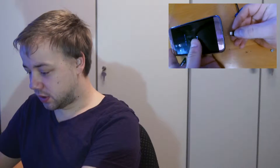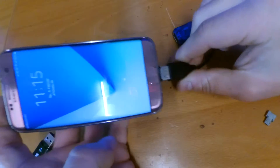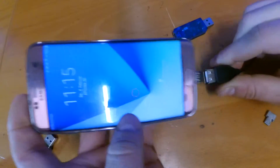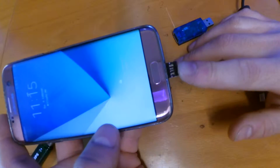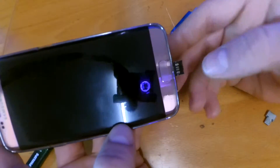So you can connect, for example, the WEMOS D1 Mini. It stops blinking and it is recognized by the PC, so I can use it as a USB device. What doesn't work is if you want to connect your mobile phone with this adapter to your PC, because the mobile phone recognizes the adapter as a USB On-The-Go adapter and will not allow power to flow in.